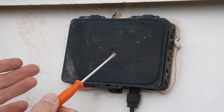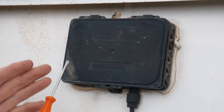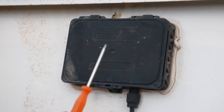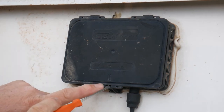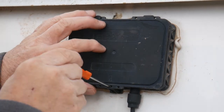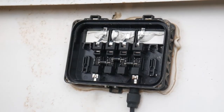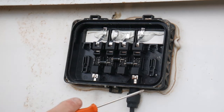As I'm missing a cable on that panel, I will open the junction box. Obviously, if your panel has the two cables intact, you can test it directly from the ends of the cables. But for me, the first step is to open this box and test it from here — then I'll be able to place the cable back. You can see there's a little arrow; I press and open. There we go — here we've got the plus and here we've got the minus.